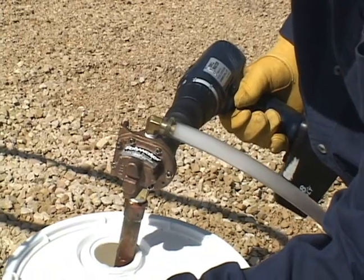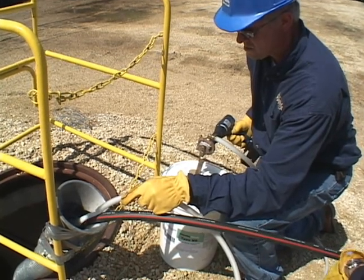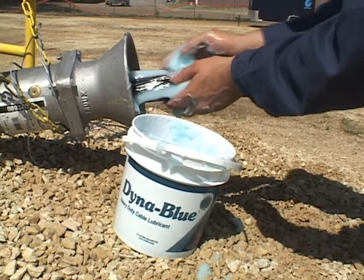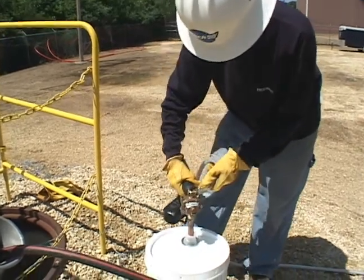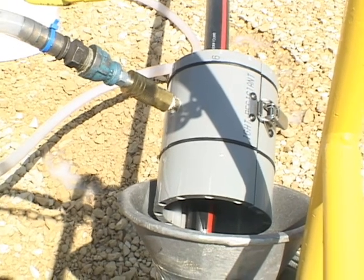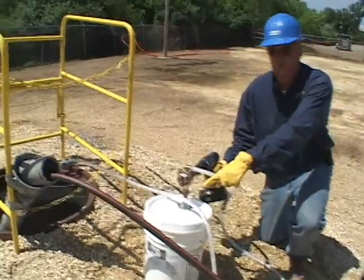The Polywater pump LPD5 is powered by a quarter-inch or larger electric drill. The LPD5 will pump all Polywater lubricants except the very thick gel DynaBlue. An extension feeder tube allows the LPD5 to draw from a 5-gallon pail or 55-gallon drum. The pump is supplied with a 12-foot output hose. Vary the drill speed to control the lubricant flow rate from the LPD5.